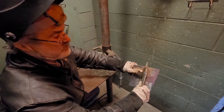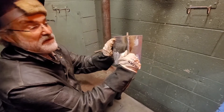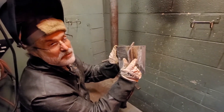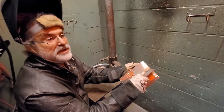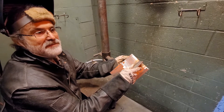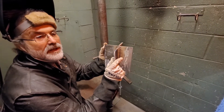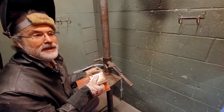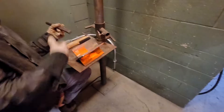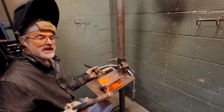As I rotate my handle, the plate will rotate up to the vertical position. Welding vertical at first is too hard to get a good weld, so typically what we do is start welding uphill with it at a slant, and then make it harder and harder as we get better at our welding. So let's connect a handle — we'll be able to put it up on the plate without having to hold it.